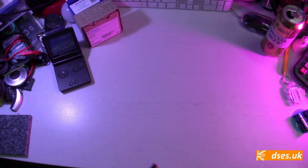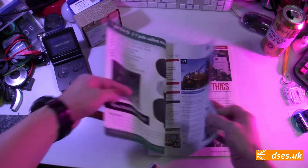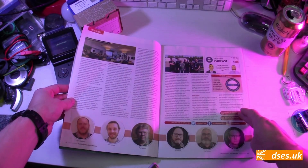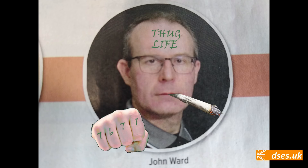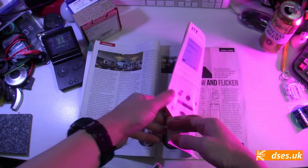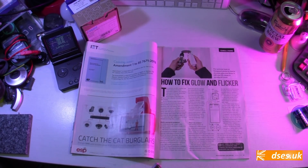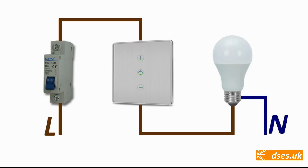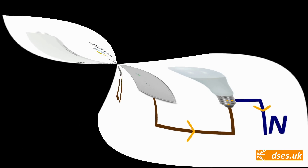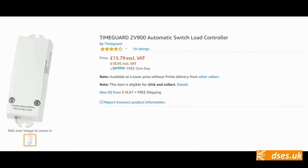By coincidence, back at work this first depressing week of January, I picked up a copy of Professional Electrician magazine from the counter at CEF. On page 41 of January's edition we find advertised a TimeGuard product, the ZV900, designed to deal less with the capacitive problem and more with one of the other causes I mentioned in the last video — where a control current has to pass from a timer or smart switch through the lamp in order to get to neutral, which inadvertently causes the thing to light. The price is a little hairy and I've no experience of the ZV900 myself, but if your nuisance glow is down to smart switches, this may be worth a peek.